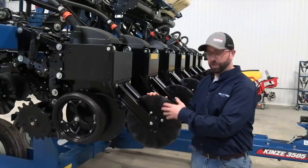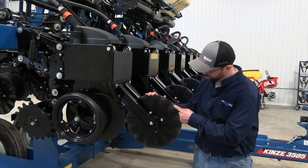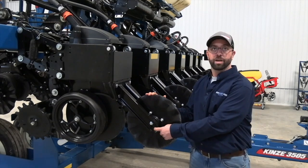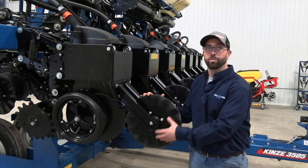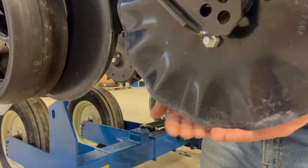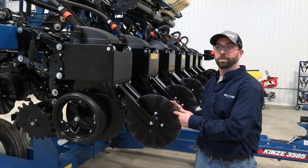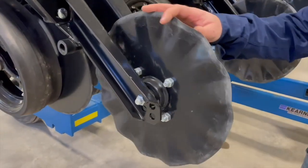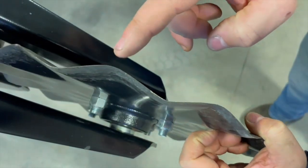We want to make sure we adjust these down as the blade wears, but also at some point — in the case of this 16-inch blade, at 15.5 inches — our cutting edge is gone and we should be replacing it. Also keep in mind: if you've adjusted it down on a planter new to you and then put a new blade on, now we're way too low. We never want these below the seed trench. A quarter inch to three-eighths of an inch above the seed trench is recommended. These also come in different patterns — this is a 13-wave with a three-quarter-inch cut. In tougher ground, consider a bubble or a 28-wave, which has a five-eighths-inch cut. It's important to keep these things maintained.